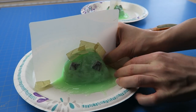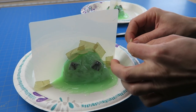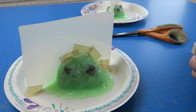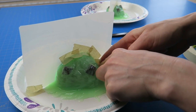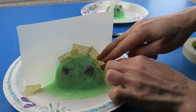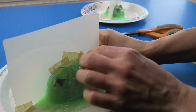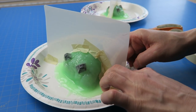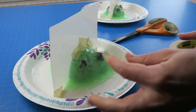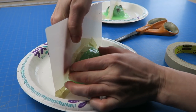I just built up enough tape to keep the mylar as vertical as possible. The most challenging part was trimming the mylar to fit closely around the silicone. It's not perfect — if this were something more precise I'd take more time getting it perfect, but for this project the gaps where resin might get underneath are not really an issue. I didn't add any release to the mylar because it already releases pretty well from epoxy.